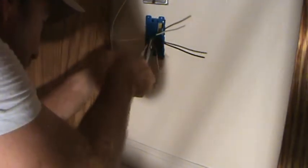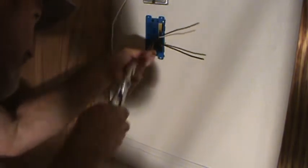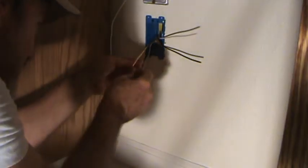First, I'm going to grab my pliers. I want to give it a couple quick spins. Okay? You just don't want to overdo the spins. You spin it, and in fact, I'm going to do one more just to make it a little tighter. Okay? But you don't want to do too many of them. Because let me tell you, you spin it and spin it and spin it, you think it's tighter and tighter and tighter, and pretty soon it snaps off. I've done it before and I've seen others do it.